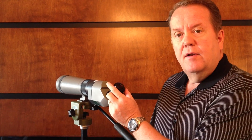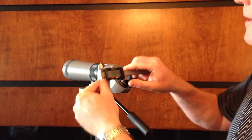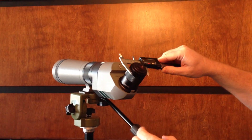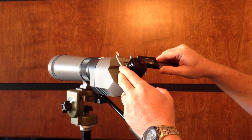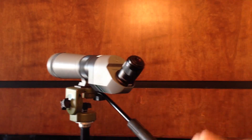So what we're going to try to do is get a distance measurement across the outside diameter of this eyepiece. I've got a set of calipers here, turned on and zeroed. I'll open these calipers up until they fit over the main large diameter of the body of the spotting scope, and it's telling me it's right in the neighborhood of 1.830 inches.